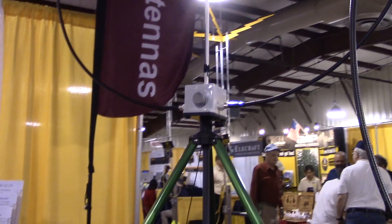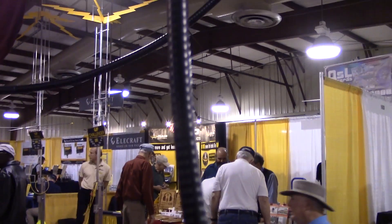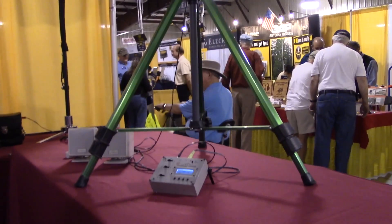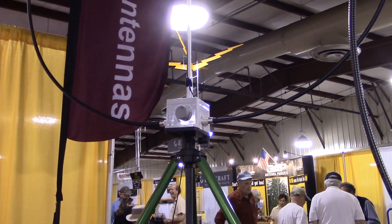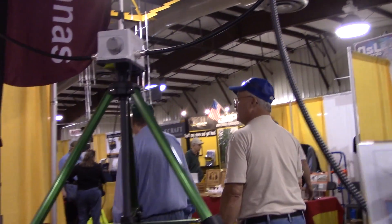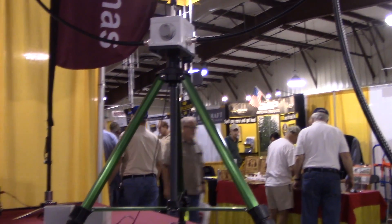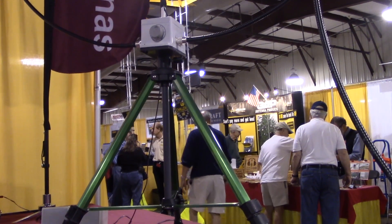The adapter we're going to be providing will accommodate the little quick release that mounts on cameras - we just didn't want to get into the tripod business. When you said hardline - you can see there's a close-up here - that is not LMR-400, that's hardline. That makes it a lot better. If you use a braided cable, RF doesn't like rough edges, it likes smooth. That's another opportunity to get the best performance out of the antenna. This one's got a manual tune, but we do have a remote-tune loop that we're going to be introducing probably at Dayton.